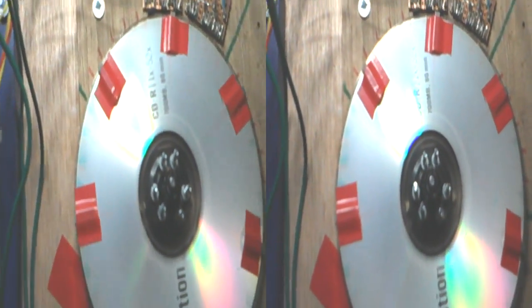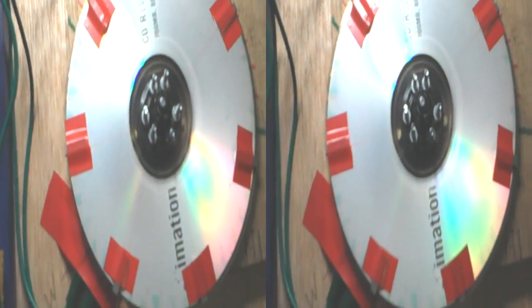5 sixths of 30 kilowatts is 25 kilowatts. So that means it will be delivering 25 kilowatts. Okay. So this will be running, and you can see that it's running at 568 field cycles, right? That would be the equivalent of somewhere around 120 miles an hour. But because we're using an 88% mark space ratio, it wouldn't actually manage that, because it's only a 30 kilowatt motor.